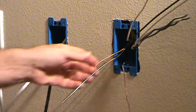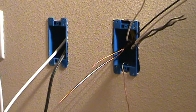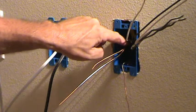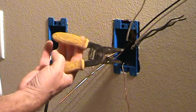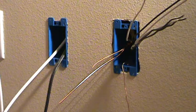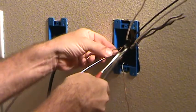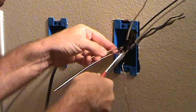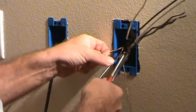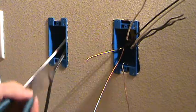That's going to keep those together, but I'm also going to put the little ground cap on there. Push that back in and smash it on there. Some wire strippers have a little nib right on them that you can use to dimple the cap, but these are the cheap ones I've been using forever, so I just do it with the pair of pliers — grab the edge of it and pinch it on further. That's not going anywhere.